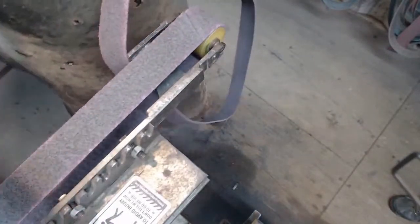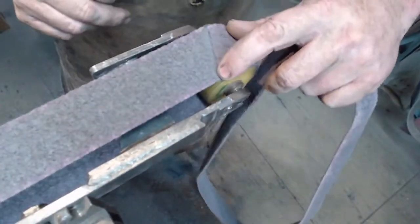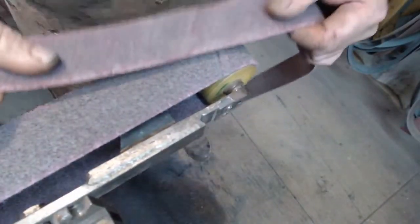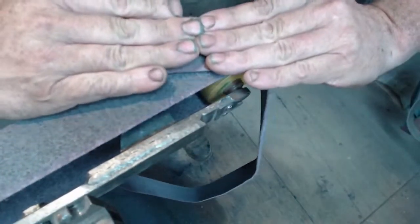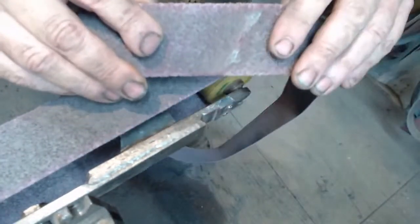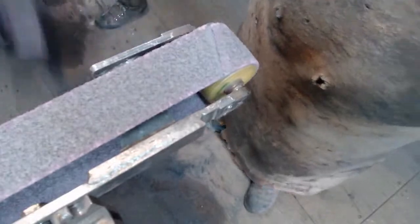This one, on the other hand, let's do this really close up. Here you can see that straight edge right there indicating that you've got a lap join. This one here, on the other hand, is a butt join. So those two surfaces are meeting up perfectly. So if you've got a butt join like this, normally with tape at the back, you can put them in any direction. Direction doesn't matter.